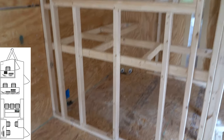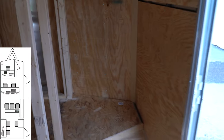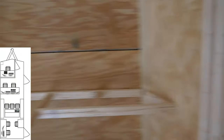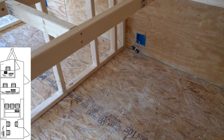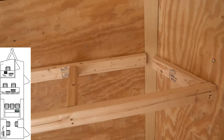And now the crème de la crème is the audio booth. So essentially, as we had mentioned, what will happen is once you step in, we're going to have a door here, and we will step in. And again, following that countertop, we'll have our 22-inch countertop here, 32 inches high, and some plexiglass here that we will be able to maintain visual contact with the monitors up top for the multi viewers, as well as visual contact to the director or technical director. But overall, the idea is we're going to soundproof this with carpet, of course, and the audio guy will have quite a nice little workspace.